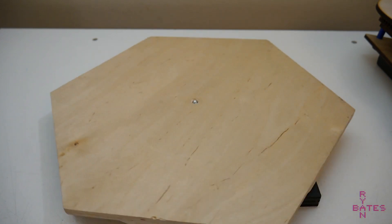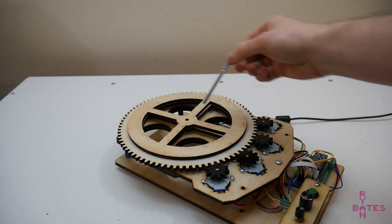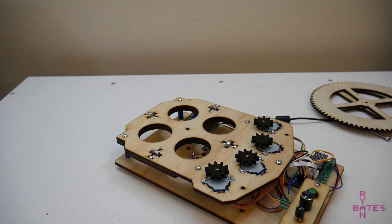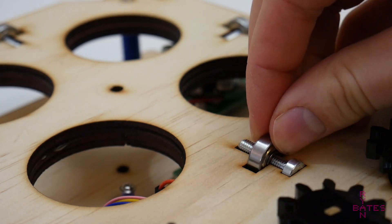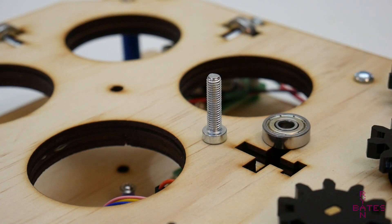We need something cheap that has adjustable speed and can hold some mass — say 5 pounds to be safe. The solution for the turntable is again: why buy it when you can build it? The rotating platter is comprised of 4 bolts and 4 5x5x16mm bearings — that's 4 M5x20mm bolts and 4 625Z roller bearings — which comes to under $6 in parts, much cheaper than an actual turntable bearing.